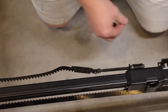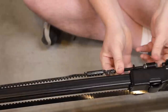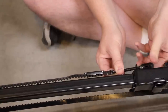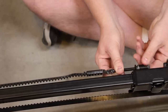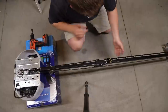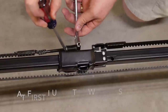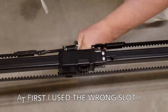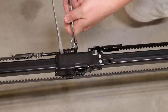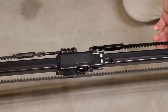To tension correctly, pull this as tight as you can with just your fingers and thread it on until it's finger tight — there will be a fair bit of slack to take up in the belt. Do a last check to make sure nothing is twisted and the belt is running in the correct orientation. Take a flathead screwdriver, wedge it into one of the slots in the back of the bolt, then use a wrench to turn it about a quarter turn. This will tension the belt to just the right amount.